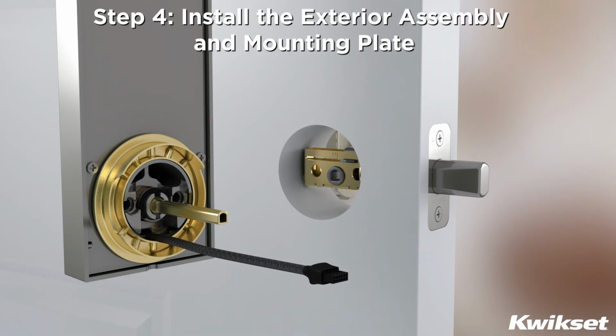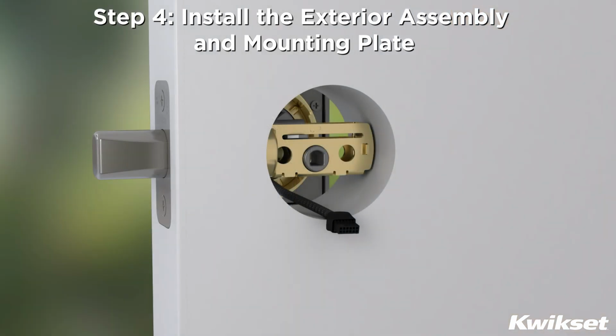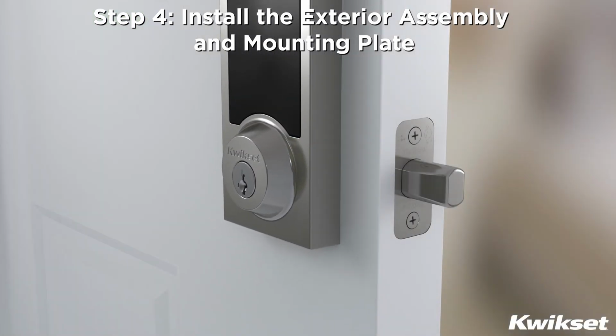Step 4. Install the exterior assembly and mounting plate. Route the cable underneath the latch. Insert the cylinder torque blade through the latch by aligning the D shape of the torque blade with the crank. Firmly position the exterior assembly onto the door.